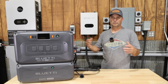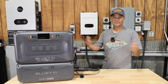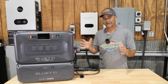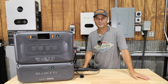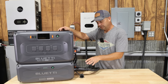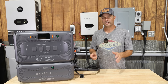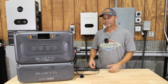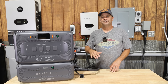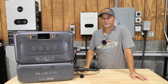The Solar X4K is meant for a more permanent solution — you mount it on a wall, hooked to a ground-mounted or rooftop solar array, not portable panels. It gives you significantly more solar capability for your power station. If you have multiple power stations, you can get the cable with three XT60 connectors doing around 1,160 watts each, or get one Solar X4K per power station to charge at up to 4,000 watts each — though you'd need a separate solar array for each one.